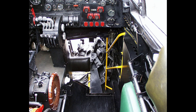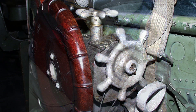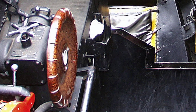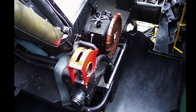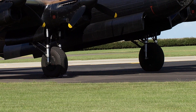We shall now look at the aircraft controls. The elevator, rudder and aileron trimming tab controls are located on the right of the pilot seat. All operate in the natural sense and each has an indicator. The undercarriage lever is locked in the down position by a safety bolt which has to be held aside in order to raise the lever. The bolt engages automatically when the lever is set down. The undercarriage may be lowered in an emergency by compressed air. There is no automatic lock to prevent the undercarriage being raised by mistake when the aircraft is on the ground.